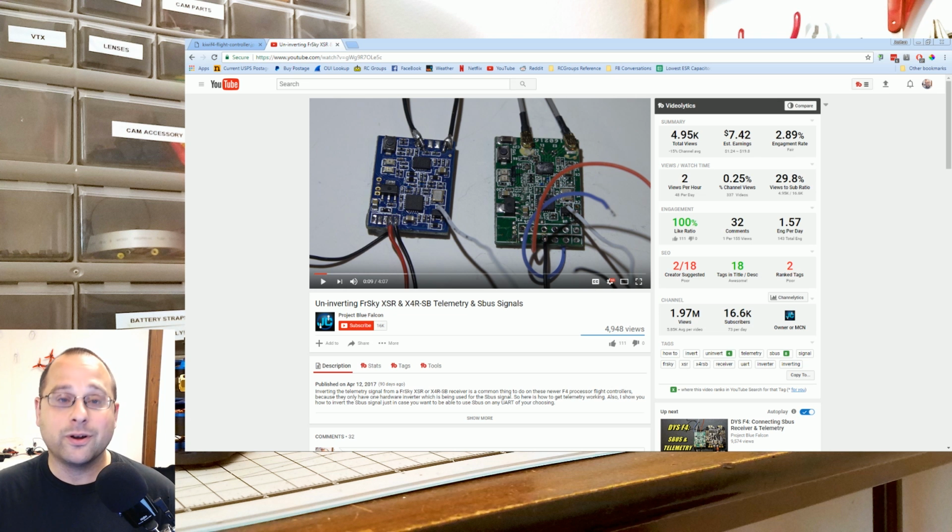And rather than me tell you how to do that, I'm going to refer you to a video from none other than Project Blue Falcon. Just go ahead and watch his video, and he'll help us out even now that he's gone. Basically, you solder a wire where he shows you how to solder the wire, and then you just solder the wire to any available UART. For telemetry, it would be a TX pad, and it'll work because now the signal's not inverted. We've bypassed this whole inversion issue.